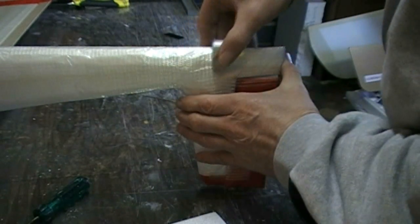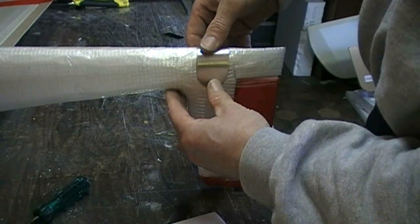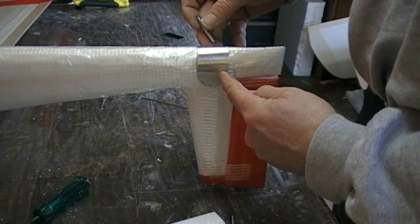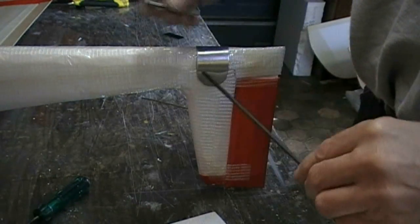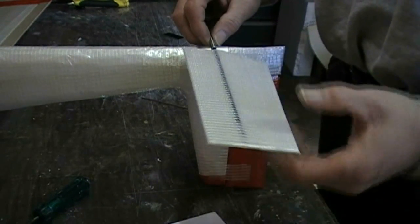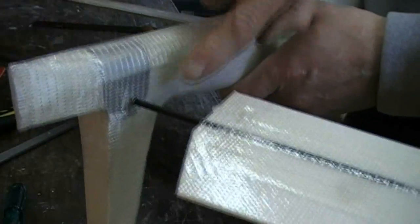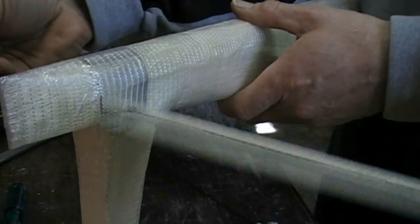I have taken a small piece of aluminium. I will put this on here and glue it, put up some tape, then drill a hole through there and glue this stainless steel tube inside. That will be like a hinge. I have now glued in the aluminium and the stainless steel tube and it works very nice, very stable.